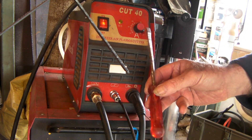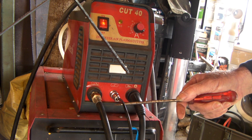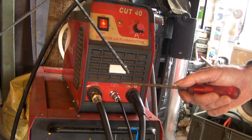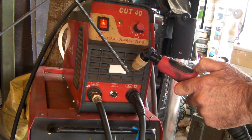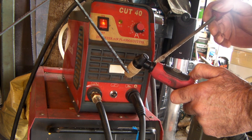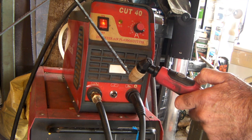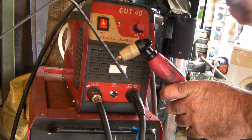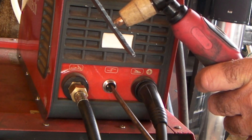Here's a little hack - grab yourself a screwdriver guys, make sure it's got an insulated handle. I only do this with plasma cutters that have the low voltage coming out of the switch here - just the little two thin wires. Most of these Cut 40, Cut 50 machines out of China are the same. What you need to do is just undo that and take out the trigger switch plug like that, and just leave it on the ground. Grab your plasma torch - what we're doing is seeing whether the switch is broken on the torch, or whether there's a break in the wire between the switch and the connector. Grab your torch, don't touch the button, put it on whatever you're trying to cut - this is just earthed with the earth strap. Grab your screwdriver and stick it in here and hit the two prongs.